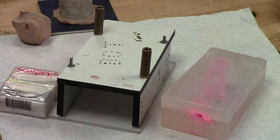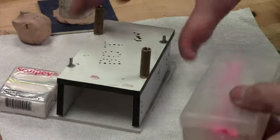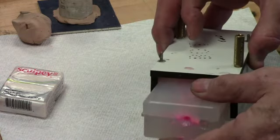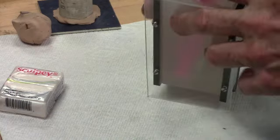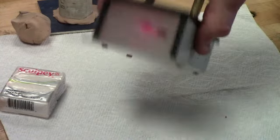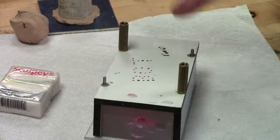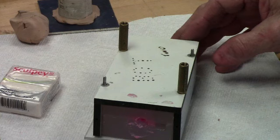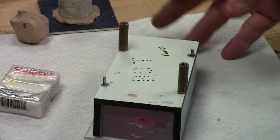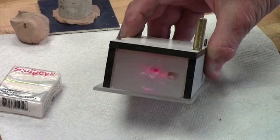and you don't have to worry about cutting. Because once the top and one side is tapered, when you take your model out and get ready to inject your wax, it slips down there and you can just give it a little tap, and it locks the mold in, just like on the tapered molds done with the cylinders. It prevents flashing. It's a very effective way to make larger molds.